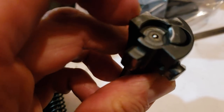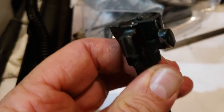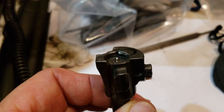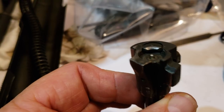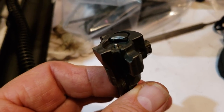Just so people understand: if you push the tip of the firing pin, you can see how it's kind of flush there — but you have a little bit sticking out. So when the hammer strikes that pin, you want it to be like that. You want it to extrude there a little bit, the tip of the firing pin. If you let go — boop — see how it does that? That's exactly how you want it to do it. The other one didn't even do that, but that's what I'm trying to explain.